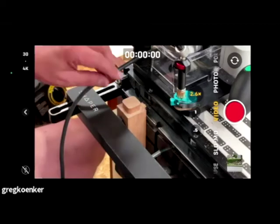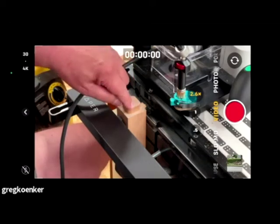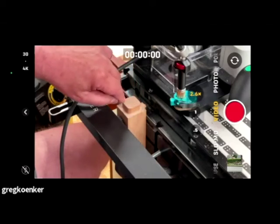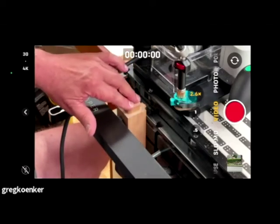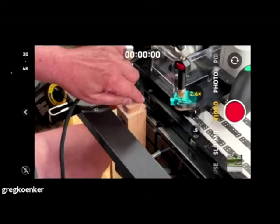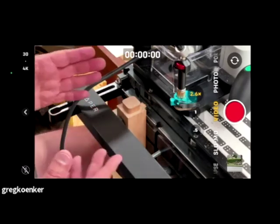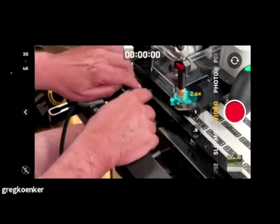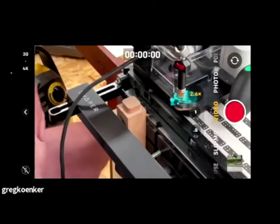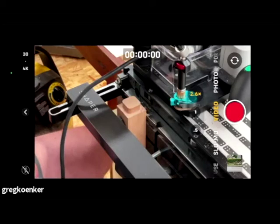In doing this cut, I did 2 quarter-inch deep passes, and I did them with no offset. If I was doing this for real, I would have done a 5/1000 offset on both of those passes, and then I would have done a final pass with 0 offset to trim that all up and get it right up to the edge with no load, basically. I also would have started on the outside, but I wanted to show you the shape that it was going to end up with. Would you likely also make like 3 or 4 passes at a lesser depth?